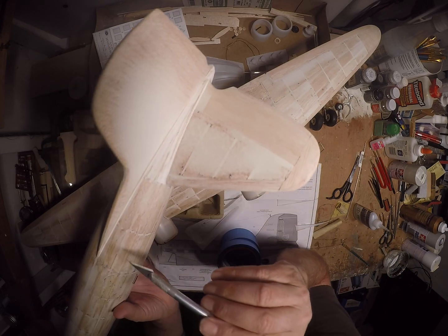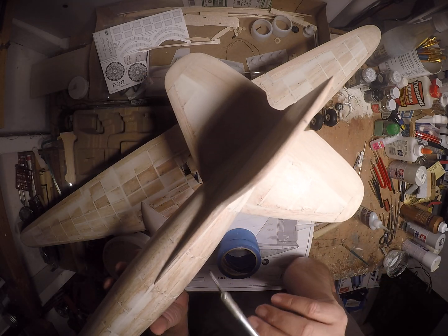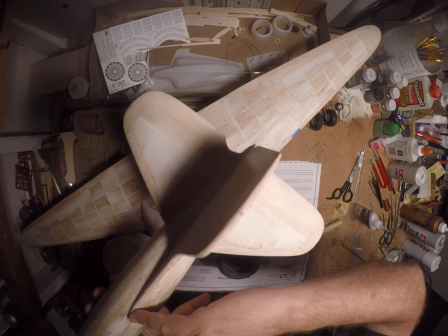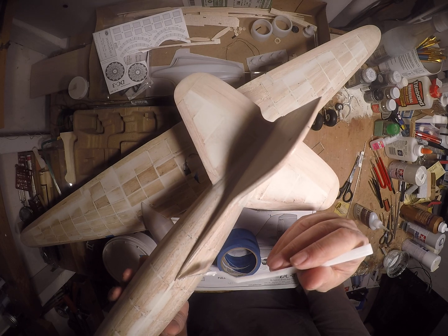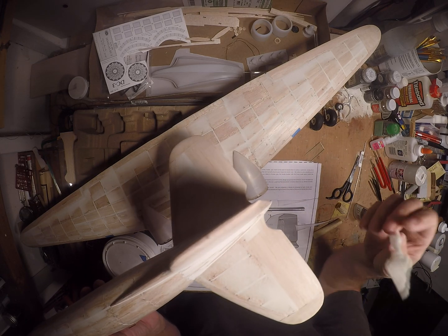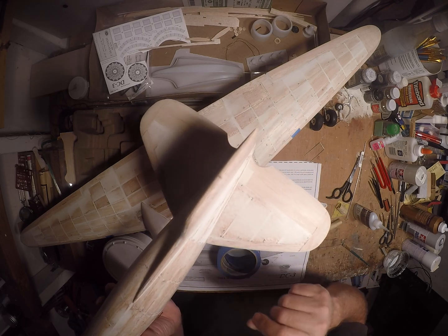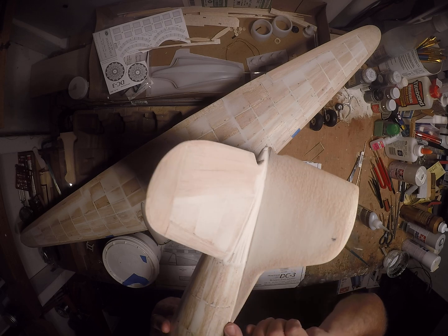The first thing that goes down is a bead of white glue that you then drag, almost like you're caulking a tub. Once the white glue is dry, you come back with the Sherwin-Williams, and you just wet it 50-50, and then you do the same thing. You're basically caulking that line with just the end of your finger, or in this case I dragged the spatula all the way down the length with the filler, and then wet the finger and pull off the excess from either side, so that you end up with the caulking. The only place it can't come out of, based on that maneuver, is the area that you want it in. I don't know if that makes sense, if you're following that. But in other words, you can't lose when you do it that way. It just goes right where you want it.